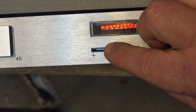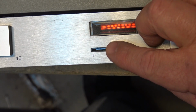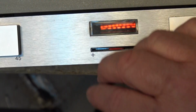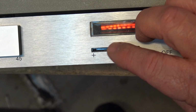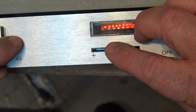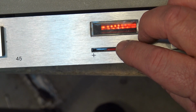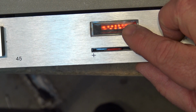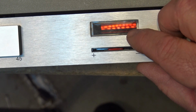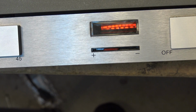So when we're going the correct speed, the strobe disc is not moving at all. And we'll change our speed here. This will be our 45 RPM. And there's our 16. Of course, our 16 and our 33 both are the same, right? Because it's half the speed. So there's 16 showing up here, and then 33 1/3 is showing up there, and then 45 is the bottom one. And that's how you set your speed on one of these turntables.